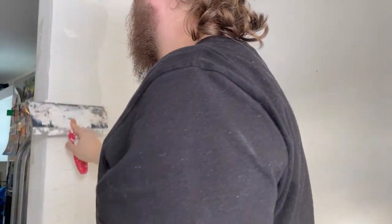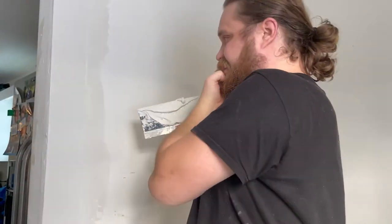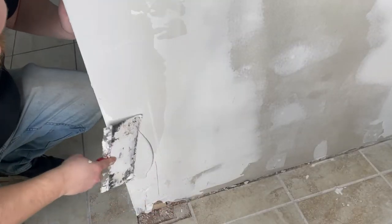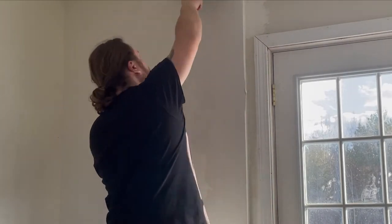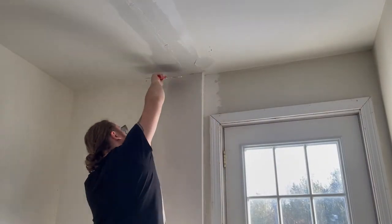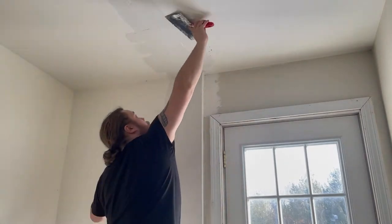After covering all my seams I let the first coat dry. I laid this coat on pretty thick and because of that it took almost a whole day to dry and I got some pretty significant cracks — but that's okay, we're going to cover all that up. The second coat can go on much lighter than the first and I do try to get smoother passes here and eliminate some of the high spots so I have less sanding to do later. What I'm learning works well is to make wider strips of joint compound that overlap my drywall more than I think it needs to. Having a larger surface to sand later allows the transition from joint compound to drywall to be more gradual and less noticeable.